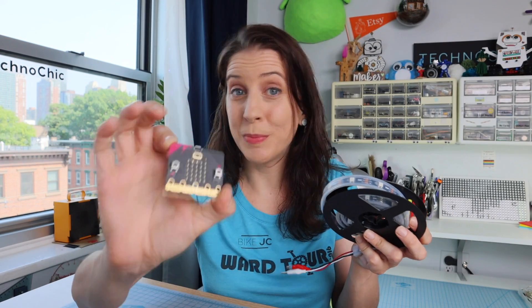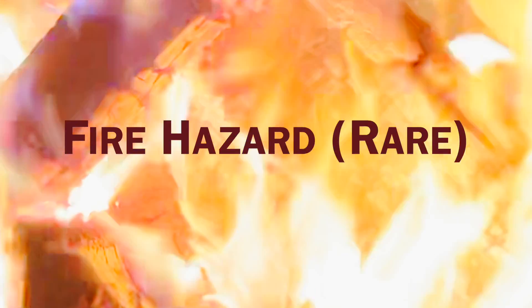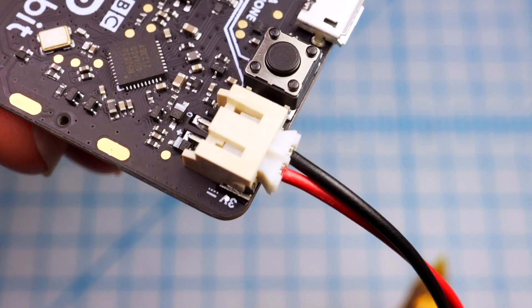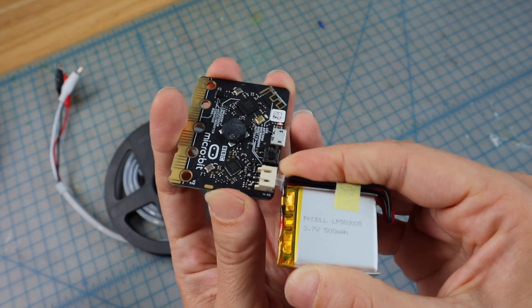We have our LEDs to go blinky, we have our micro:bit to be our brain — now we need a power source. We talked about the batteries in the kit not being enough, so what is? I recommend getting a LiPo battery that's at least 500 milliamp hours. They come in all sorts of sizes — the larger the capacity, the more expensive and the larger the physical size. This project is recommended for adults because although these batteries are generally safe, I want you to make an informed decision. I'll put some information about battery safety in the comments. When looking at batteries, a red wire indicates power and a black wire indicates ground. There's also a little ridge in the connector to only make it go in one direction. I have links to reliable batteries for this project in the description, but if you're shopping elsewhere make sure the polarity is correct.